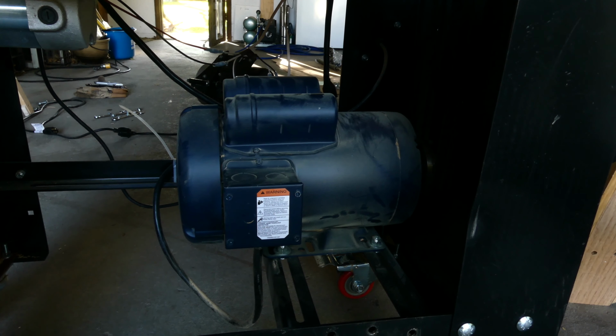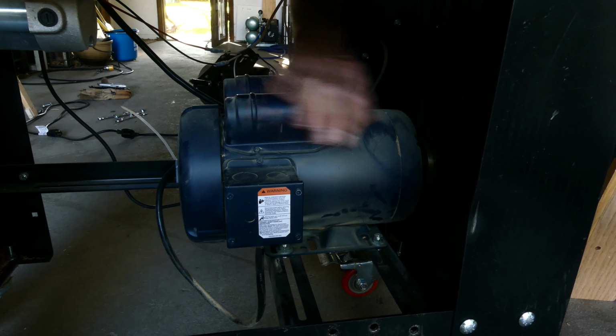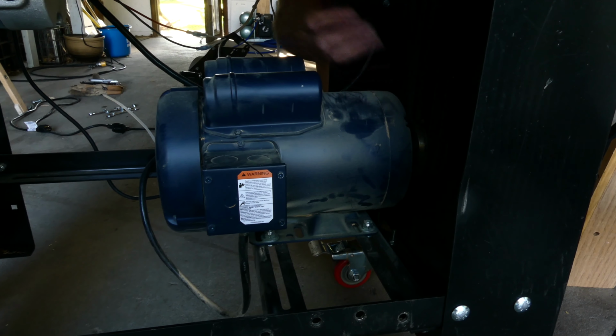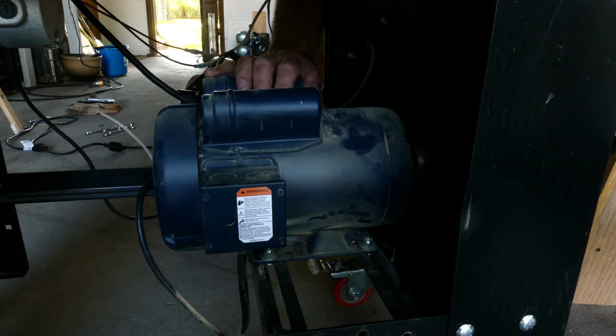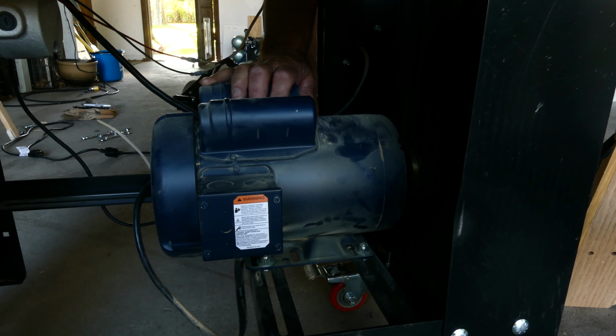The next thing we need to look at will be on the motor itself, your drive motor. There are 4 bolts that hold it in place. If you could loosen those and slide it to the in-feed roller side to give you a little counterbalance, so when you put your drive motor onto your Chatternator, it will not be as nose heavy. So it'll give you a little counterbalance.